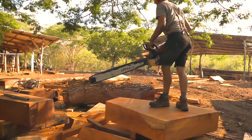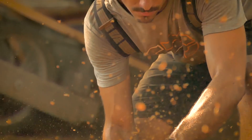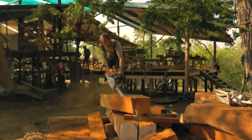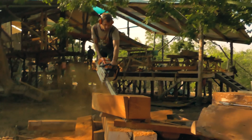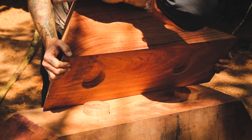The horn timber is quite a puzzle — it's probably one of the stranger pieces I've ever built on a boat. It consists of five or six pieces, all with a lot of angles and a rabbet cut running through it and bolts. It has the top end of the rudder shaft.